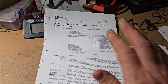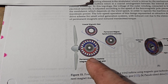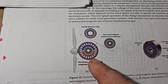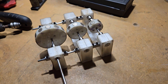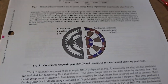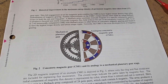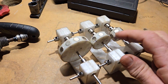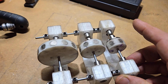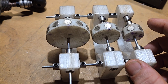I found a couple papers talking about magnetic gearing — definitely cool reads. Here's the topology of the windmill generator. It's a coaxial type system, just like a linear gear train. Here's another paper from NASA talking about using magnetic gearing instead of mechanical. There are a lot of advantages: obviously there's no friction, no fluid. If it gets out of sync, it's not going to tear any teeth — you just have to restart the system again.